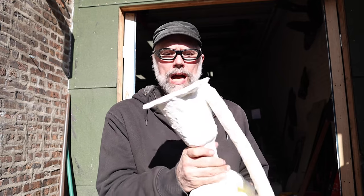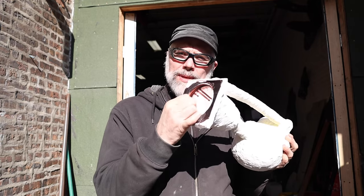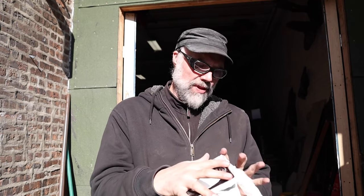Okay, so now that we've sliced it open and popped the wax lid off of our cups, you can see how they're nice and exposed. We can still see the styrofoam inside. Now the reasoning for the styrofoam is that I want everything about the cup and the sprue system to evacuate as quickly as possible so I can get my pattern wax out before it cracks the main shell. And I found that with the styrofoam inside, it just vaporizes,